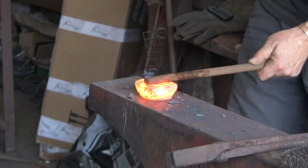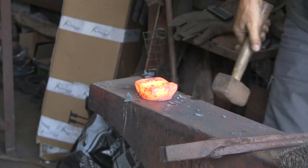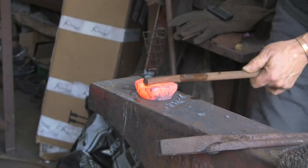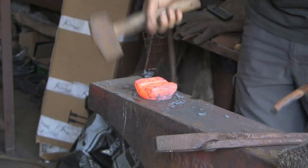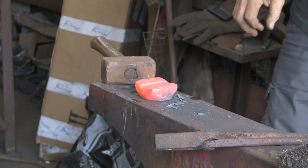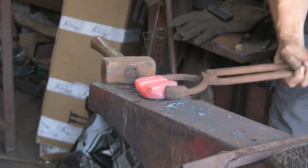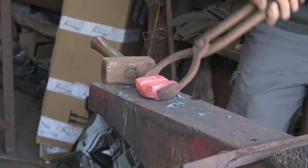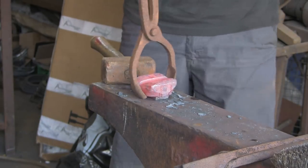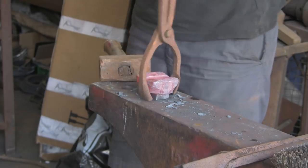And I'm hoping that if I judge it right, the 16mm 5/8 round will swell and fill out the gap. Basically, I'm making the job out of just a piece of 5/8 round, or 16mm round, whatever you like to call it, so I don't have to do too much altering of material. That's the whole idea anyway, because he said that it doesn't have to be exact as long as it's somewhere near, and to get it exact would mean an odd size material to start with, or you've got to do a lot of grinding, mucking about with it.